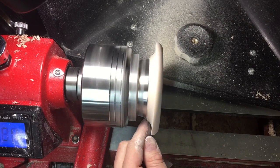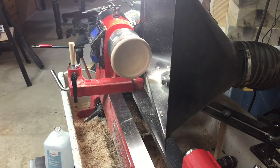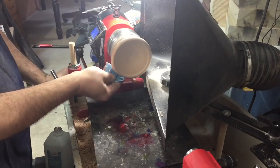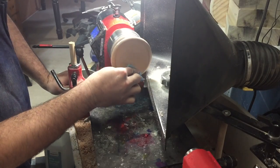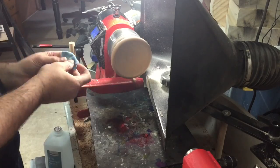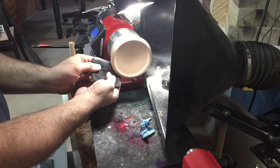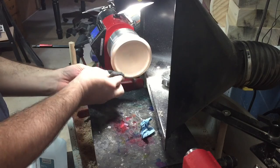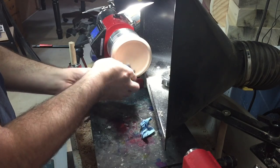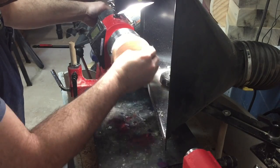It'll really have an impact on the final piece. To finish the finishing, I'm going to use some 91% rubbing alcohol to clean up some of the dust and the resin from the sandpaper. Then I will sand it again quickly and lightly with 2000 grit — the last sandpaper I used — to knock down any raised grain from the alcohol.